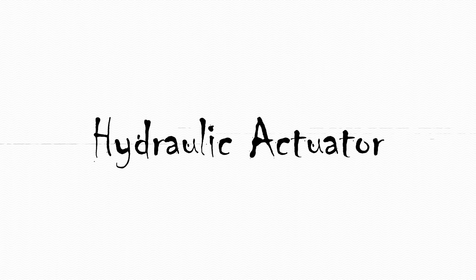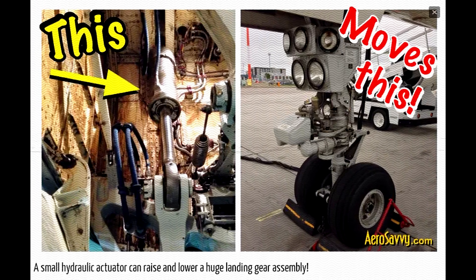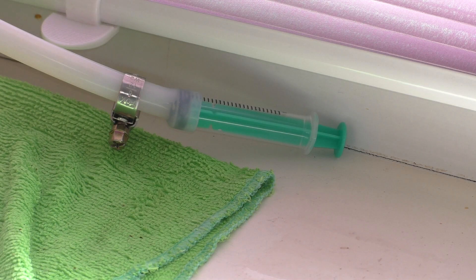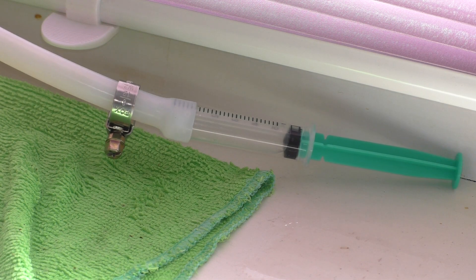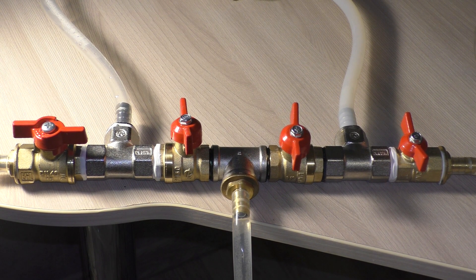Let's now make a hydraulic actuating cylinder with the same principle. It is an assembly with 4 gates. The bottom pipe is the input, and the side ones are return lines. If you open gates 1 and 3, liquid goes to the right syringe, moving its piston to the left and pushing the liquid from the left syringe into the return line.